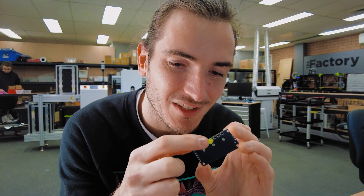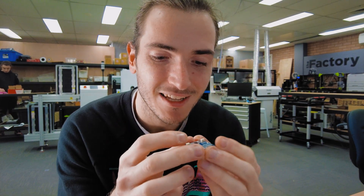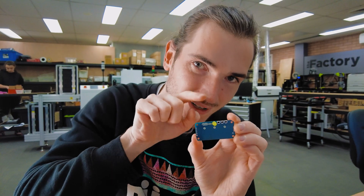Of course, this is a prototype, so we've just soldered a five millimeter LED there, but that ought to be a rear mounting surface mount LED, so that when we place all our parts on the back, we can still place an LED on the back, but have it shine through a hole in the board at the front.